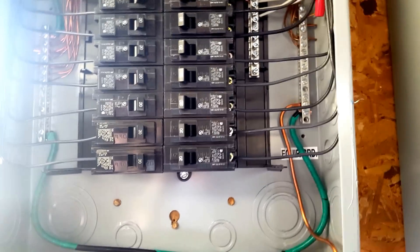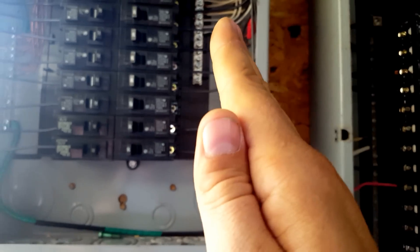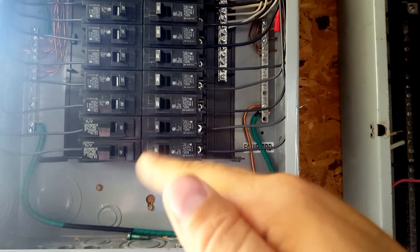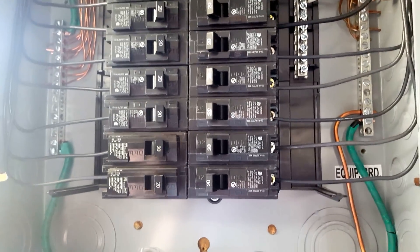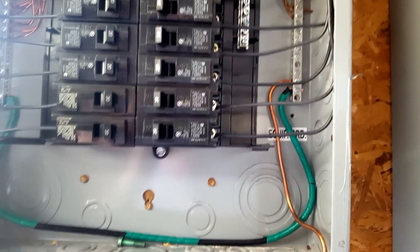Well, I've got 3,000 watts of solar coming in — that's actually about 2,890 watts is the most I've seen. The least I've seen with 96 amps is about 2,500 watts. Amps times volts equals watts. I've got a band that goes from 25 volts to 29 volts, and in between that is the amount of voltage I'm getting into the battery. If I've got 29.4 volts times 96 amps, that's 2,800 something watts. So I'll be able to run something like half of a dryer or so.